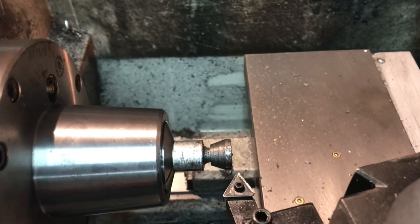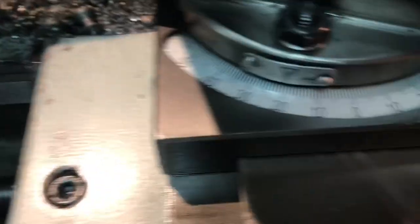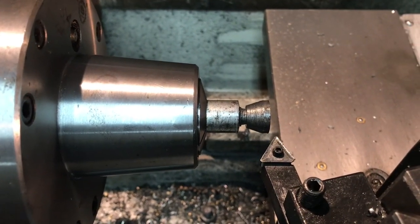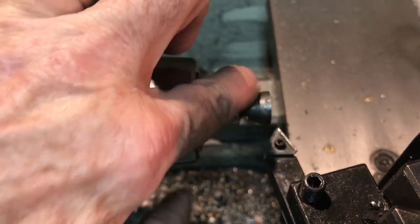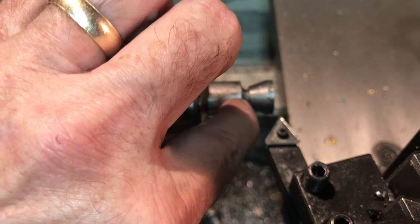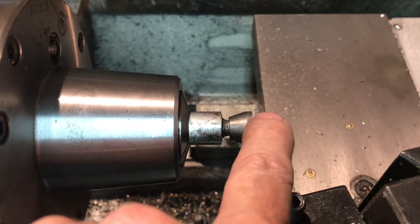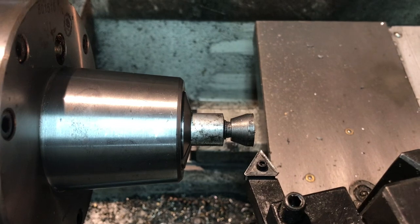For this segment - building the bolt for the tilting bracket - I've just machined the cone that will go on the outside towards the operator. I've got a 20-degree angle set up, and I'll leave that the same for all the different turning operations. I started with a 5/8 inch thick piece of steel, left an 1/8 inch shoulder, then used the cutoff tool to go down to 5/16 inch diameter. I made it a little bit lower so when done I can drill out the center and remount for the collet to pop loose - a little trick I learned from one of Mr. Crispin's videos.